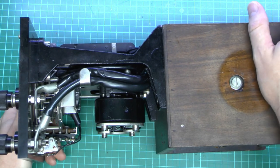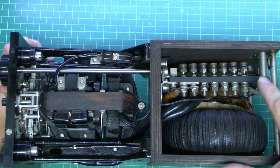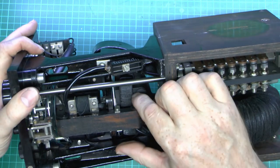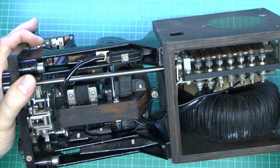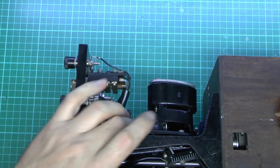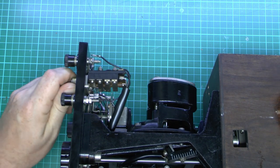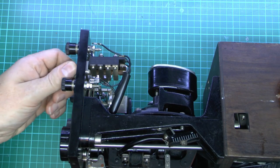As well as the two main wires coming down to the transformer and switch assembly, we've also got these two thin black wires, which are coming back from one of these terminals on this side. The other one actually goes around underneath and connects to one of the others. These actually come up onto the metering part itself — there's a little coil or winding arrangement around the bottom here, so presumably this is some kind of current transformer. Depending what current you put in, you can change the ratio of it to obtain a reading on the metering part at the top. And the voltage inputs — the potential ones — don't actually go down to the bottom at all. They just basically connect into the little coils on the back, so there's no actual switching done there apart from on this little switch, which just goes between the two voltages. That's probably two coils either putting them in parallel or series or some similar equivalent arrangement.